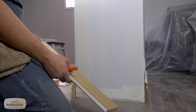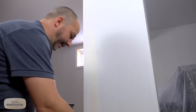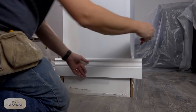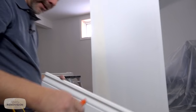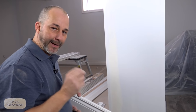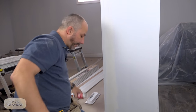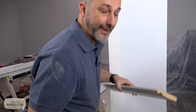So one of the secrets that I like to incorporate when I'm working on a small box or something like this, when I'm trimming, is don't worry about being perfect with the measurement. When you're putting this all together, nothing is going to be perfectly angled, nothing's going to be a perfect measurement, nothing's going to be a perfect cut. So make the error by making everything just a little bit bigger than is necessary, because what we're going to do is install this with our No Nails adhesive. And we can use a real thick bead, and I'll show you how this is done in a second, but